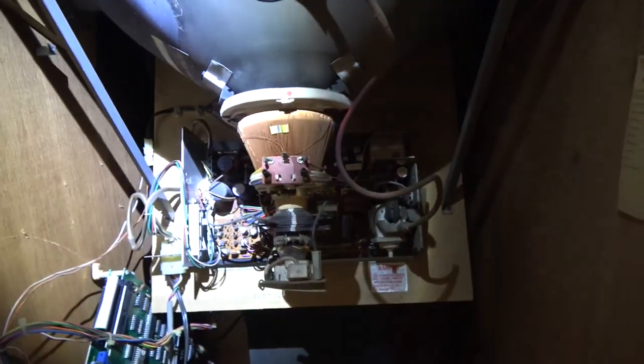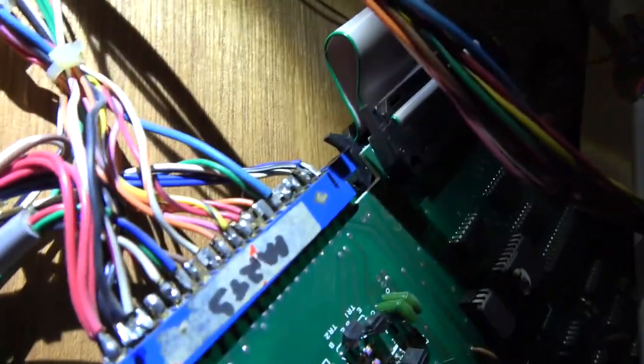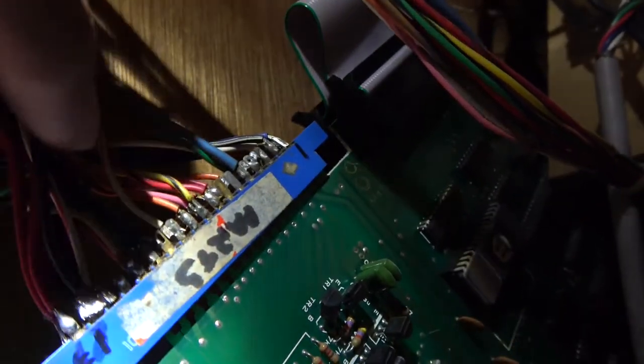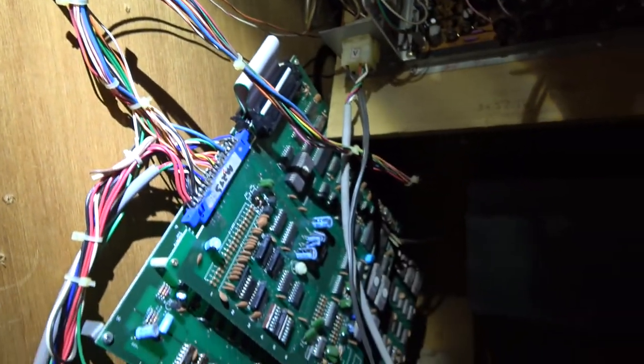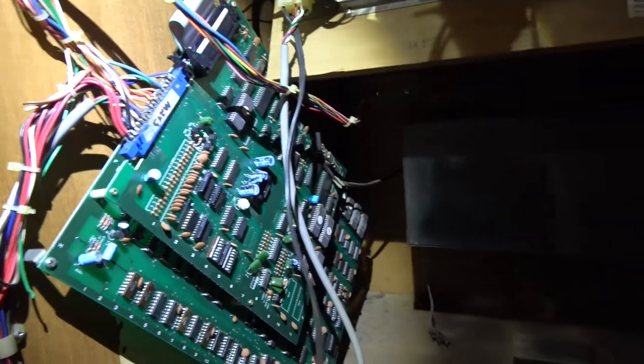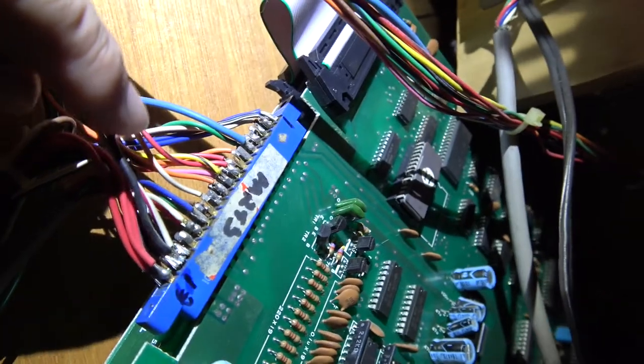The monitor — we suspect it may have a chassis problem, but I'm not so sure now. When I brought this home I had a look inside and this wiring looks pretty dodgy. This earth doesn't look good at all, and there are other things cut in here. I don't know why, but that might be from the original changeover from Defender to the Hyper Olympics board.